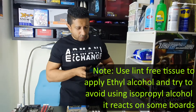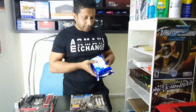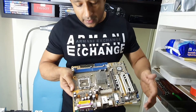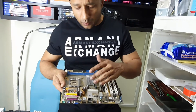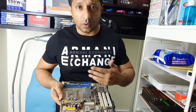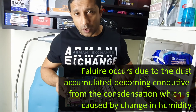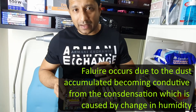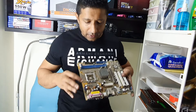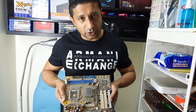This is a very simple LCD cleaner that I might use, and along with that I am going to use these wipes. The problem is that if you have dust settled down due to the humidity and climate here, there will be condensation when the PC is turned off or when the AC is working and turned off. That condensation causes water droplets on the board, and combined with the dust, makes the whole thing conductive. As you can see, the MOSFETs are covered, and a lot of chips are covered, which could cause electrical short circuits.